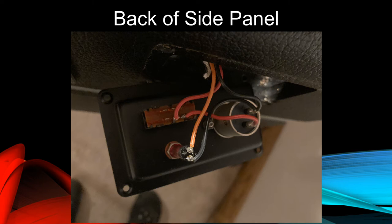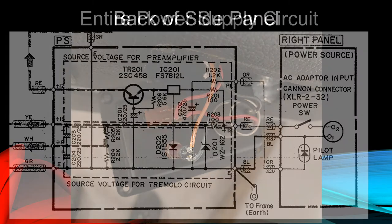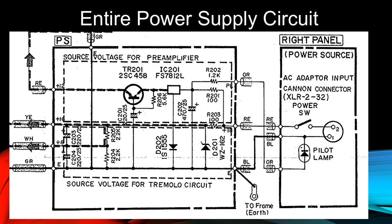The orange wire on the other terminal is the power feed from the regulator board for that light. The rippled DC power enters the piano through the cannon connector indicated by the red circle on the right, with the plus DC power on pin number two and zero volts DC or ground on pin number one.